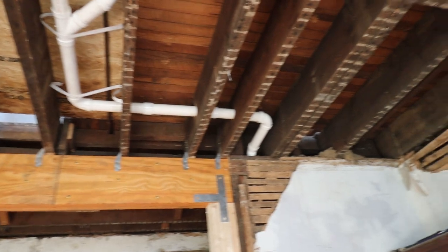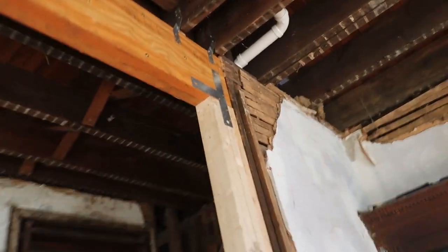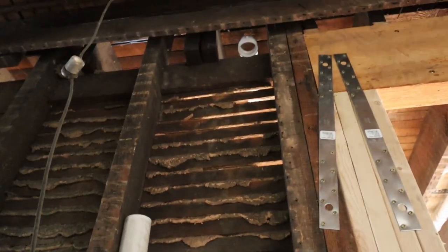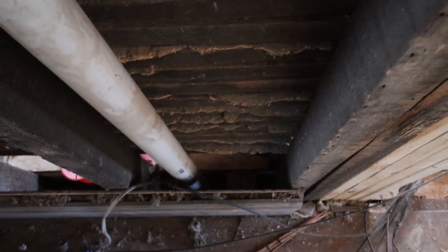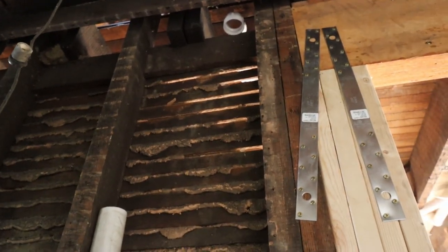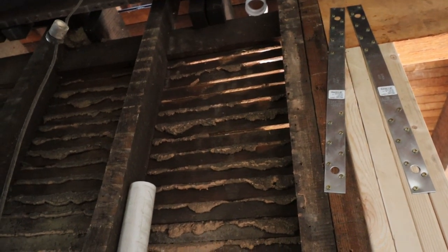Gonna go along the joist and then down here into the ceiling. And there I still have to connect it, but it's gonna go basically almost straight down. I can't go straight down because there are some floor joists right underneath there. So I'm going to add a little move to the left here, two elbows to go left and then back down.